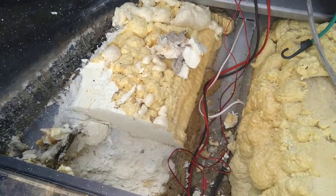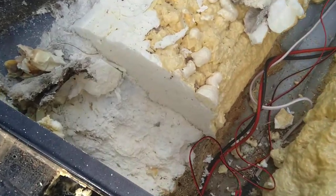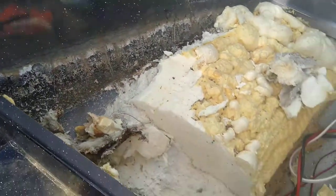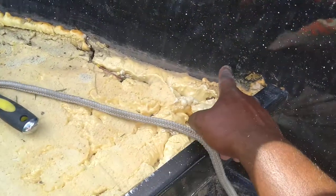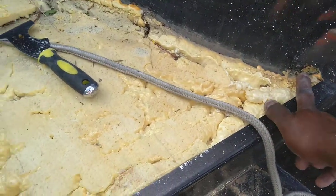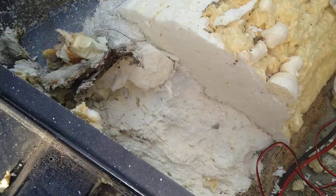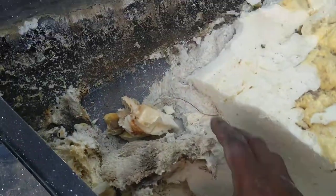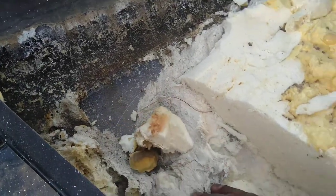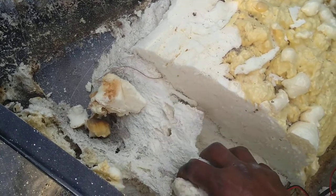Here's a video on my frustration. If you saw my earlier video on this RH Pro-V fish boat, I had mentioned you should have a water drain in the front over here, otherwise the foam is gonna get waterlogged. And guess what — look at this. I'm pulling this out, I was doing some work on it, I was gonna run some new wires, but look at this — this is all waterlogged.